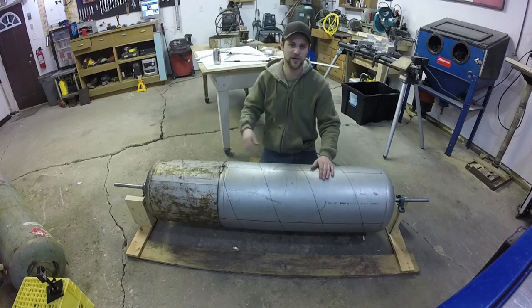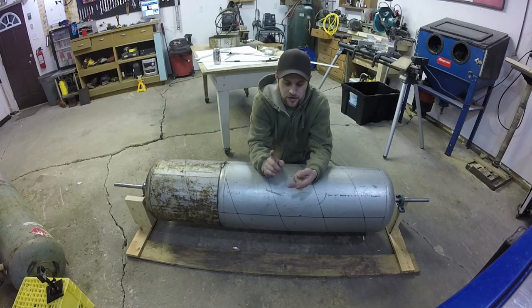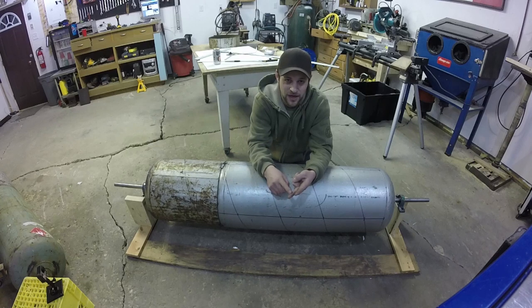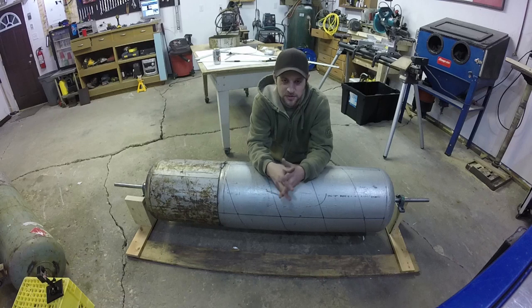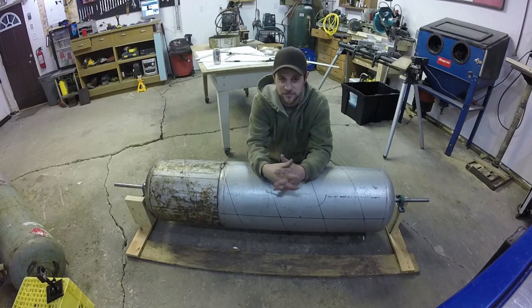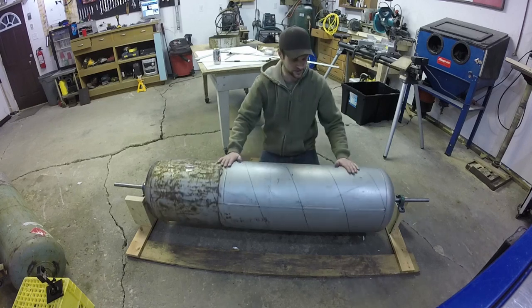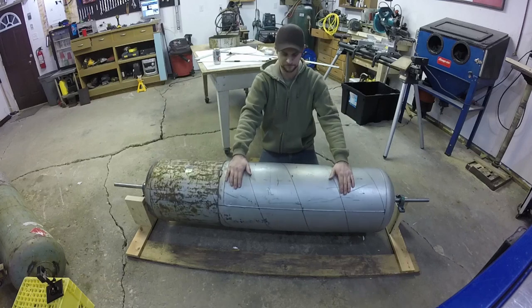And according to what I can tell from research, the Chrysler screw vehicle, I don't know if you've looked it up yet or not, has about a 32 degree pitch on it, a little more aggressive. The Fordson snow machine is a little bit higher, probably 38, almost 40 degrees. So I'm somewhere in between the two now. My last machine was probably 28 degrees, so it was a little bit aggressive, probably part of the reason I was breaking stuff. Anyways, got it all marked out. Next step is to bend it up.